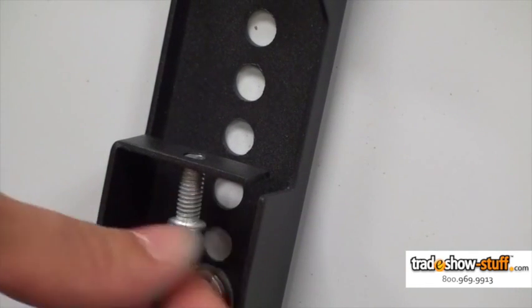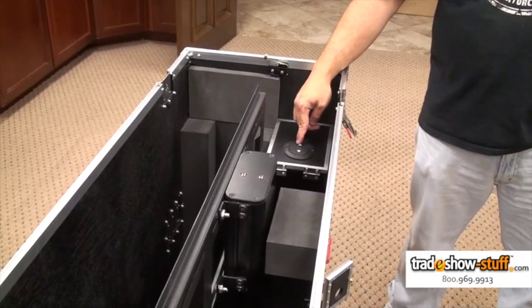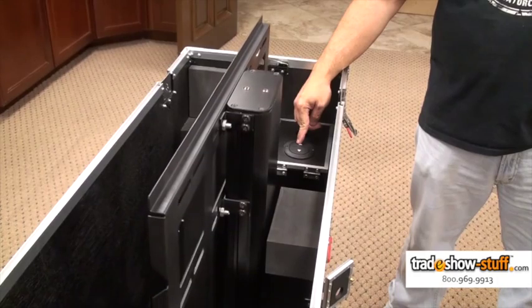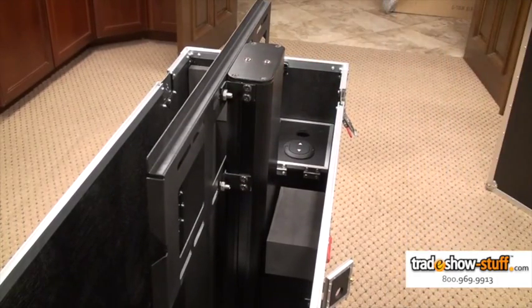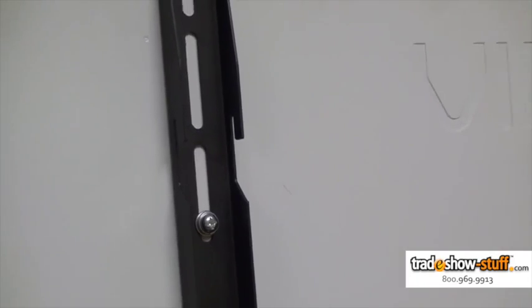At this point, just thread them until the screw is flush with the tab. Now that the mounting slats are properly secured to the display screen, you will need to activate the lift. Raise the lift until the mounting harness is fully exposed. For the next step, Gator recommends you get a helper — screens are expensive and heavy.